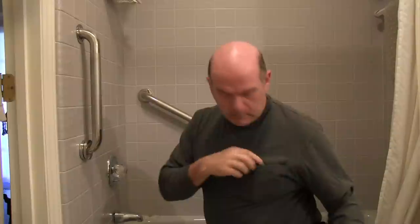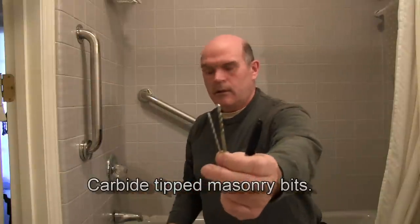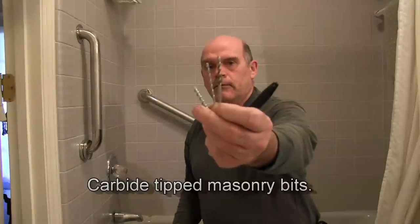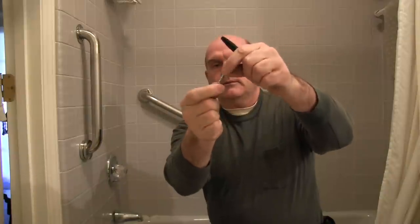I used a hammer drill to drill the holes. I set the handle up here, took my marker, held it in place and marked one hole here and one hole on the bottom. Took it off, drilled the holes. I have two drill bits that I use — one is big enough that the whole screw can pass through the tile. I drilled all the way through the tile with the big one, then as soon as I got through the tile I stopped and continued drilling with the small one. The small one is about the same size as the shank of the screw, so the drywall and the tile backer board doesn't have to be crushed out of the way — it leaves it intact. You drill a hole for the shank and that lets the threads bite deeply and securely into the backer board and the drywall.